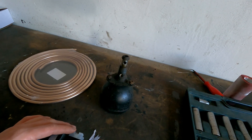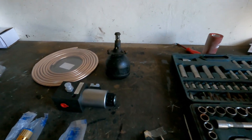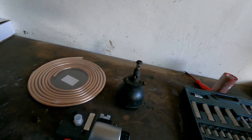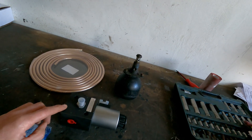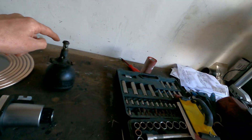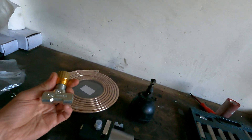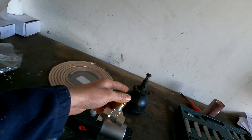The second thing is how you adjust the softness or hardness of the suspension. The original parts have standard valves in them, but those valves are pretty rare and not easy to get, so I'm going to do it a different way - an industrial approach. I'm using a 3-2 valve. I can route through the B-channel or the A-channel. One side connects to the accumulator and then goes from the A-channel to the shock absorber, or through B-channel. In between there's a reducer valve, so I can reduce the flow going to the shock absorber or back to the spring.